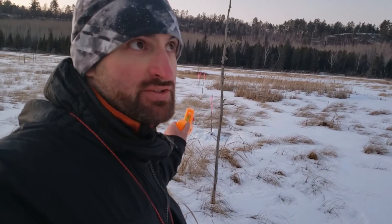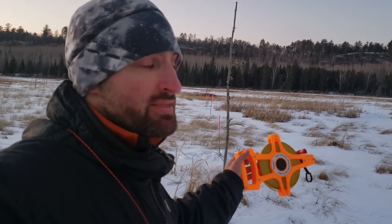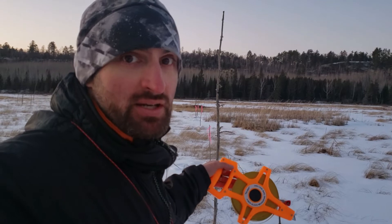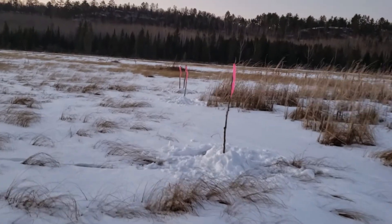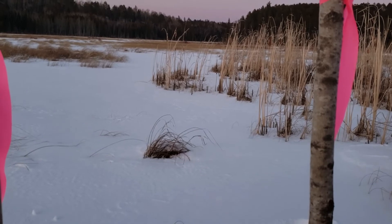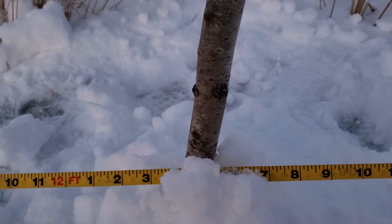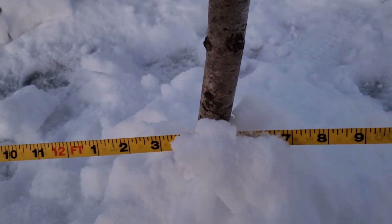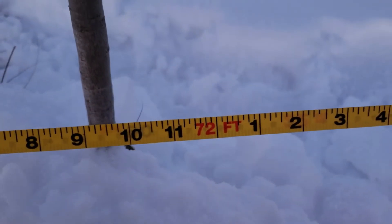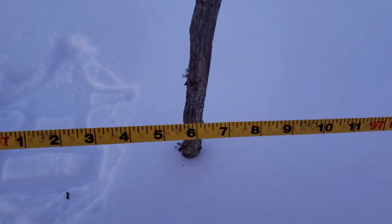I have all the stakes in for zero, one, five, ten, fifteen, and twenty degrees difference in the bearing — which also represents the difference between true north and magnetic north. I tied the tape measure on with a piece of flagging. Over three hundred feet, a one-degree difference is just about two feet. Five degrees gives a difference of twelve feet and four inches. Ten degrees is almost thirty-five feet. Fifteen degrees is almost seventy-two feet. And twenty degrees is ninety-six and a half feet.